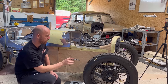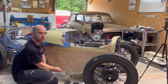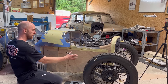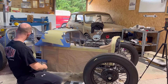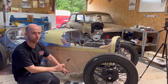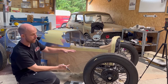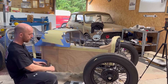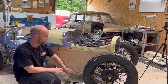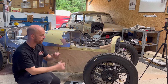That's pretty much it. I will put the swage on this panel, but I won't put the wired edge on this one yet. What I'm going to do is get this panel done to the same standard. Once it's all in place, I can then mark my line all the way through. What I don't want to do is put the wired edge on this one and then offer it up, and have it slightly on the kink — because that will throw this join line out, and I don't want that. I want that to run smooth. So I'll do that once this panel is done. You've got to do it in sections and piece everything together.